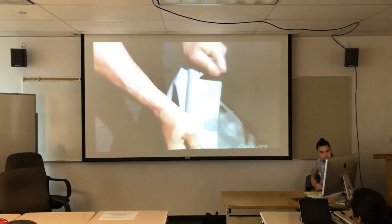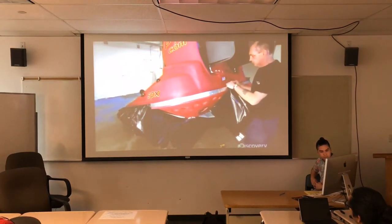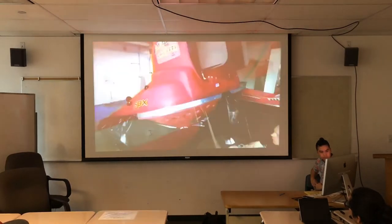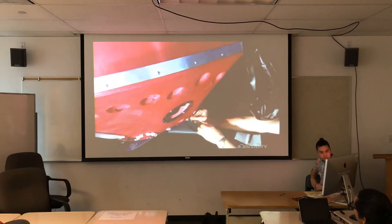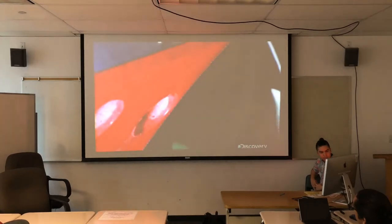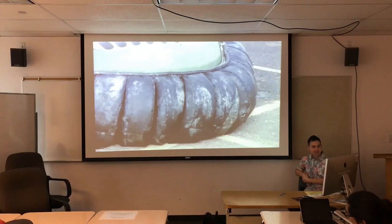The hovercraft skirt is made of the same material used on shoe soles — sturdy polyurethane nylon. They assemble the skirt to the hull in 65 different pieces; the worker loops each segment over a side bumper and secures it with a steel clip, then attaches the bottom of each skirt piece to the little hooks on the hull. Plastic cable ties are used for this job for a good reason: if the skirt becomes snagged on something, these ties will break and free that section, and other parts of the skirt will balloon out to fill the breach and maintain the air cushion.